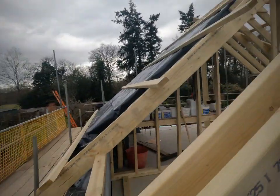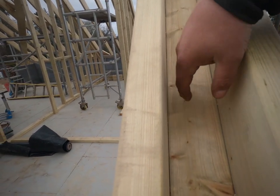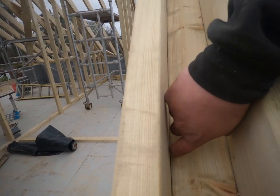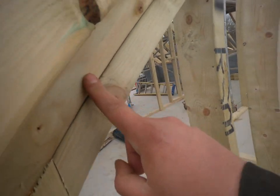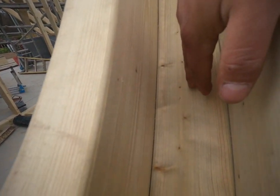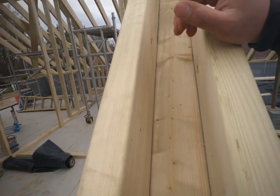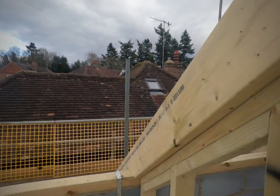If I go over the top, we've sandwiched a 4x2 in between. What the 4x2 does is essentially take your stub wall top plate and then a rafter each side — so you've got 8x2, 4x2 flat, and then an 8x2 on the outside. I call it a timber sandwich, and what it does is it eliminates problems.